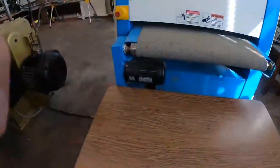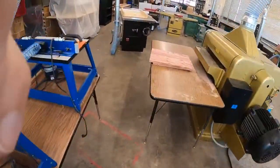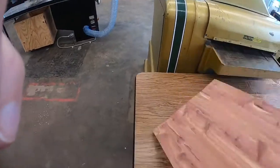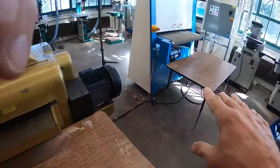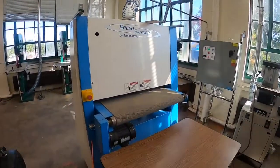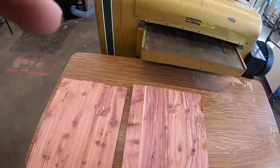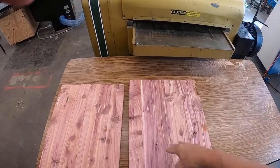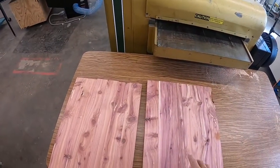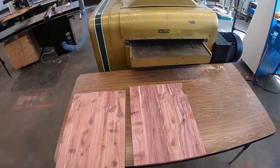You can see how it made it nice and flat. I'm going to turn off the system — turn both off so you can hear me. So that's how we go from the gluing stage, kind of rough, to getting it smooth on both sides. Then we take it from this machine, the planer, to the surface sander and it gets a lot more smooth. I don't have it hooked up yet, so we'll try that next time. After we surface sand both sides, we're ready to cut our panel to finished size — the plan says 13 by 20 — and we've got to square it as we cut it to size. Then we're ready for the next step: usually some graphics, maybe router an edge, and then the graphics with either the laser or the router with the epoxy. We'll show you that as we get there. See you next time.